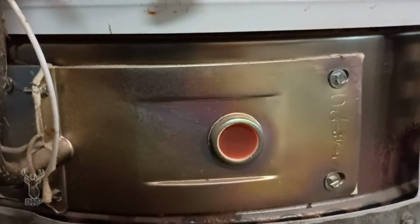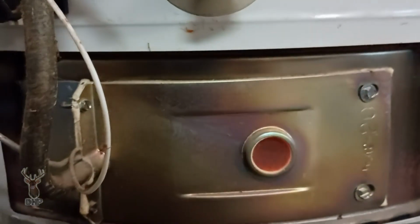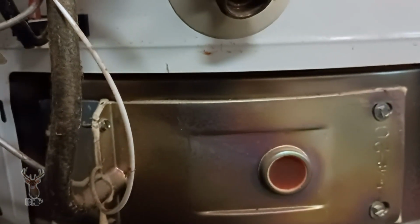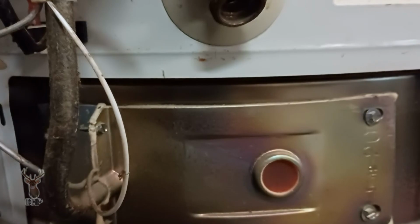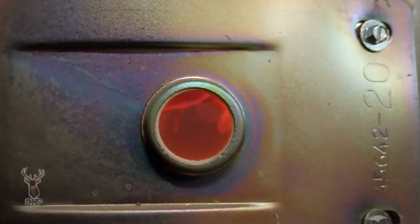With the age of this particular water heater, the tank's not leaking, but a replacement is about $1,500, and that's for the cost of the unit plus hauling away the old one and installing the new one. So the issue is, if it ain't leaking, don't fix it. But the burner's not burning right, and you can see we're pretty orange in there.